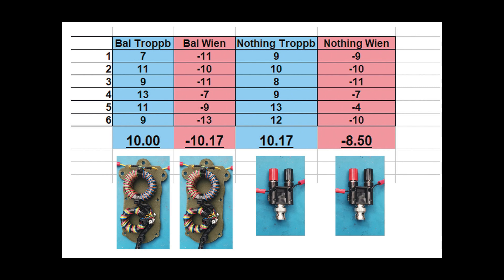Here in the Excel sheet you can see the results. The blue is always what I received, and the red one is what I got back from home — what the home station received. You can see the receiving was nearly the same between the hybrid balun and nothing; nothing was a little bit better, but not really noticeable. For transmission, what I received at home from the adapter was on average a little bit more than 1.5 dB better than the hybrid balun.